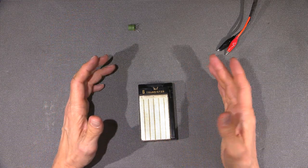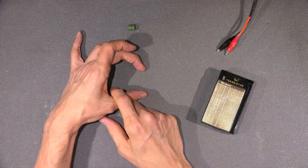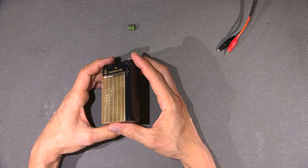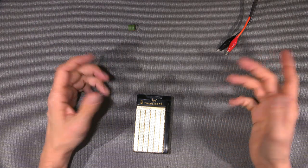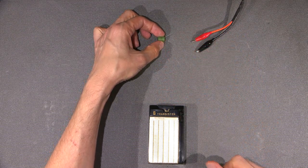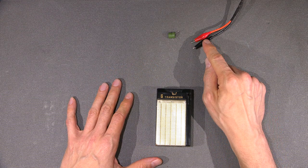So what's happening here? You can look at this the same way as your wireless cell phone charger — there's a coil inside the charger and a coil inside your cell phone. When you place the phone on it, they're coupling, and that transfer allows your batteries to charge. Well, this antenna is receiving so incredibly well that I can just take the antenna and attach it at this distance and it will couple to the antenna inside the radio. It's like the radio is attached to an antenna when really the coupling is way over here.